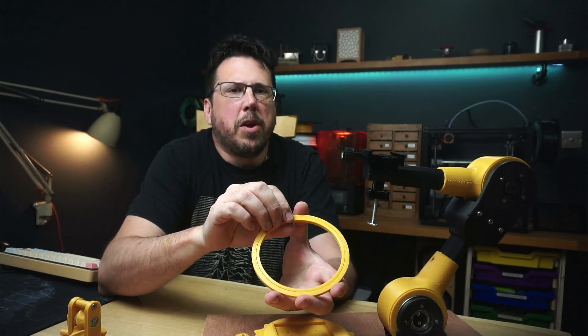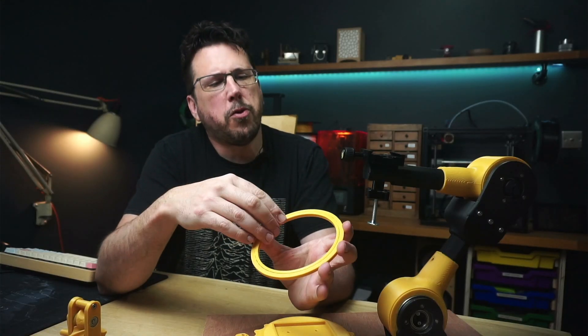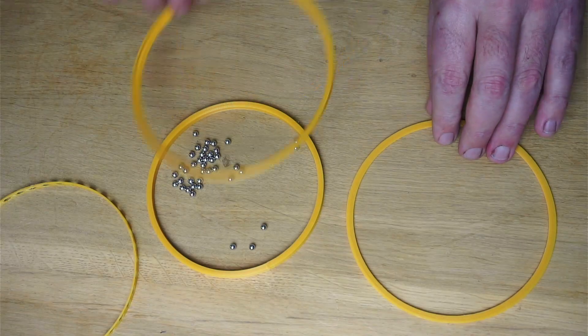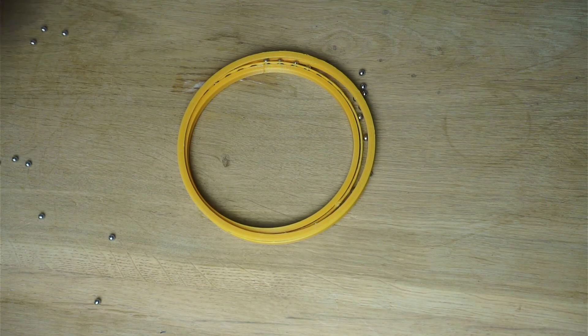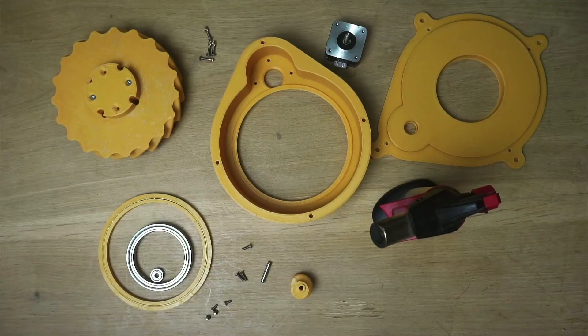So I made my own. In a previous video, I experimented with the best way to make 3D printed bearings, and I settled on a four piece design with a cage holding steel BBs in place while still letting them rotate. It can be a little bit fiddly to assemble, and the balls have a habit of escaping at the worst possible moment. But they perform surprisingly well, especially considering the cost. I've assembled all the parts we need — let's start getting it together.